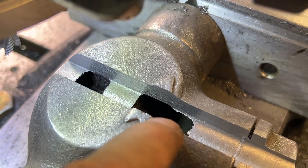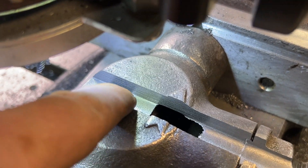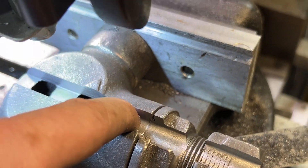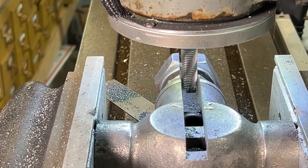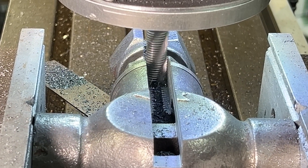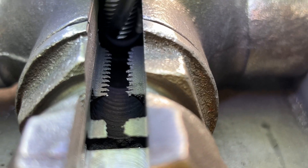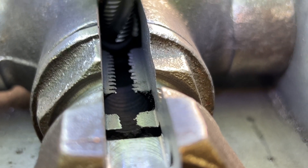We're just starting to break through — look how thick that is. They don't make things like this anymore. Nowadays this would be like a sixteenth of an inch thick on the valve. We're going to keep cutting through here — we just want to expose a little bit of these threads right in here. Now you can see we've just broken through the threads there, and I think that's great. I'm just going to polish those threads off on the side.